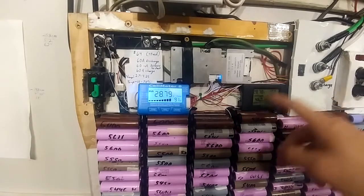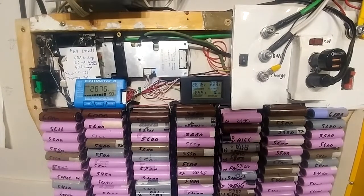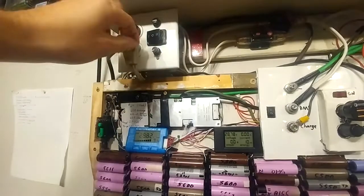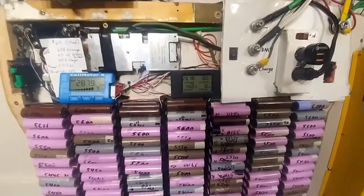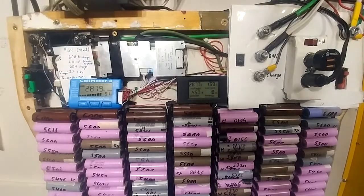In terms of this meter, I've never had any problem. It's not very accurate at low amperage, although it's doing okay right now. Adding a tiny bit more load — that jumps up. We've got three amps right now. Turn off these lights and we've only got 1.6, 1.5 amps. All I was doing was doubling how many lights are running off it. My previous video was talking about the direct DC voltage lights, and they're controlled by this controller up here. It's even got a dimmer. It's exponentially cheaper to do this system than it is to run normal light bulbs, which is kind of strange. And it's been running great for the past year — none of these LED lights are losing any of their brightness or lumens. Super happy about that.